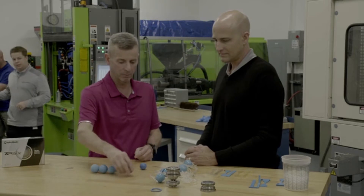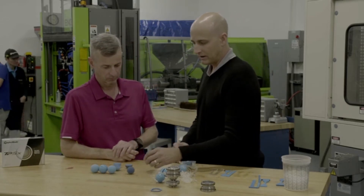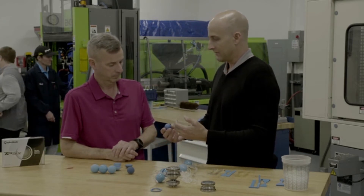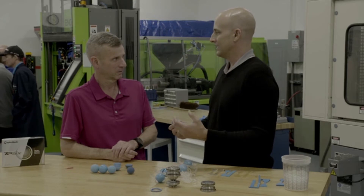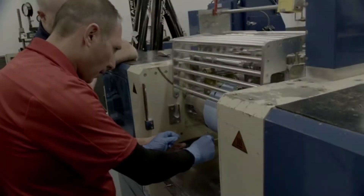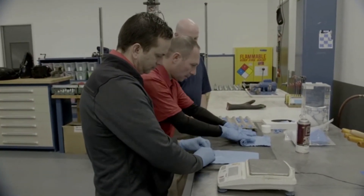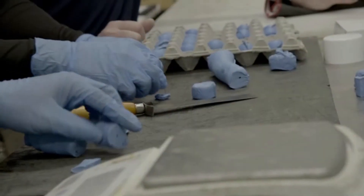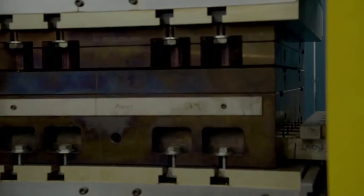So let's look here and give me a Reader's Digest version of what all these different parts are. We start with the core, and this is a polybutadiene rubber. For the TP5 and TP5X, it's a very soft core with ingredients that go into it that help us adjust the compression, the weight, and ultimately the COR. It's a process where we mix rubber and these ingredients in a two-roll mill on a small scale — we're not looking for large quantities here. Then we roll out the sheet and create these little preps.